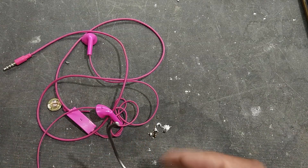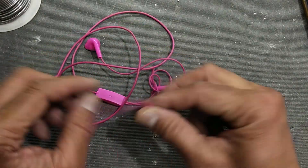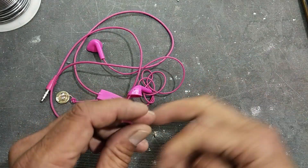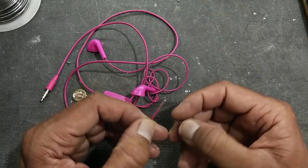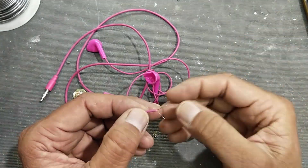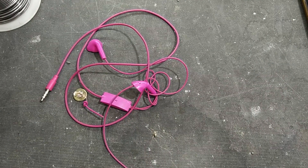If you don't have flux-filled solder, you need to use a good soldering paste — apply soldering paste, then heat up and apply solder; it will catch the solder. If you are using 40% tin and 60% lead, it will become difficult to apply solder. Never use a lighter to burn the insulation as that will degrade the metal of the wire. I hope this video is informative — hit the like button and let me know your questions in the comment box.